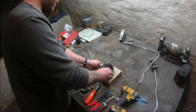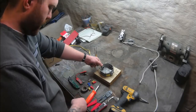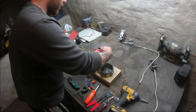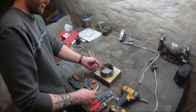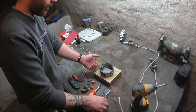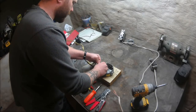From here, we're going to install the main feed. The main feed is obviously coming from the circuit breaker, so you definitely want to make sure that's off. Find that breaker, turn it off, and you're going to use your multimeter to make sure there's no power coming from it — hold either side to the black and the white, and if it doesn't light up, you're good to go. The only things you're really going to need are a screwdriver, wire cutter, some kind of pliers, electrical tape, wire nuts, and a multimeter.